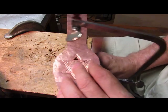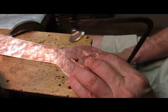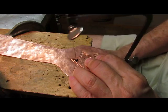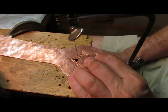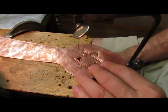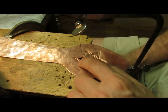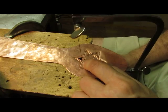And there's the first piece almost out. I'll just take out this remaining little triangle here. You'll notice that I've cut just inside my chasing lines, and that's because I want to finish the hole off with a file to give it its final shape.